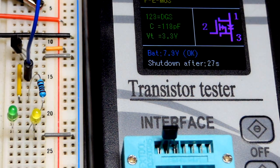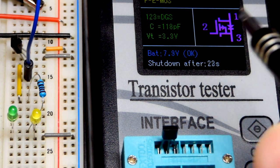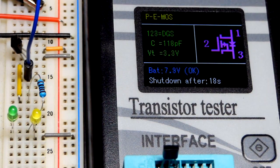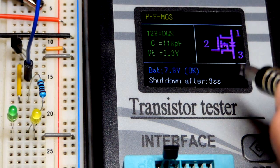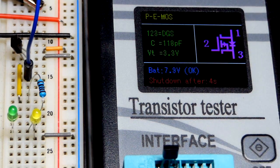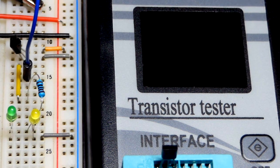And by the way, the MOSFET schematic symbols are not uniform. There's a number of different ones used even for the same component, but this one's pretty commonly used. It also shows the body diode, which is what we're actually using in this video, but that's a topic for other videos. So there you can see it normally wants to conduct when the drain is more positive than the source, which is what we have when the power supply is wired properly. And we're taking advantage of that. Very few circuits actually do, but when you use the transistor as a diode, it does.